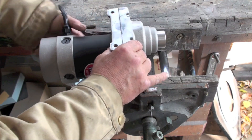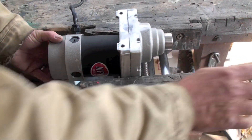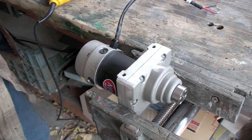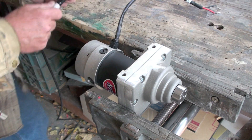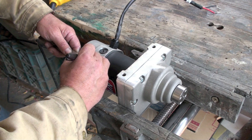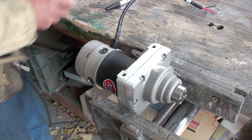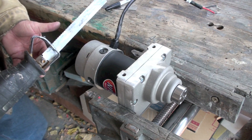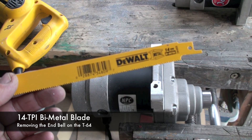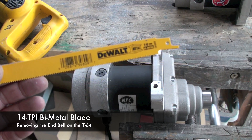It's a good idea to lock your motor into a vise. You can cut off one inch of the end bell without any problem — it lightens the motor and therefore the robot. Just make a mark at one inch, and then using a sawzall with a fine tooth blade, you can cut right through the aluminum. The blade you want to use is a very fine tooth, 14 teeth per inch bimetal blade — it will cut right through that aluminum.